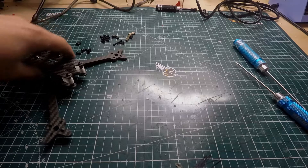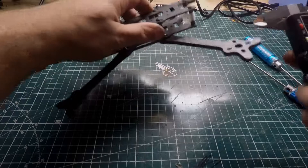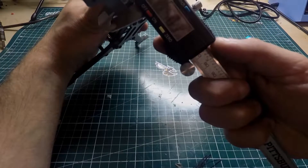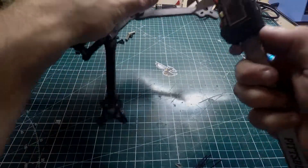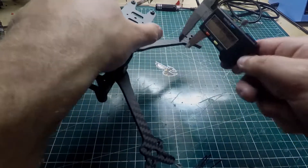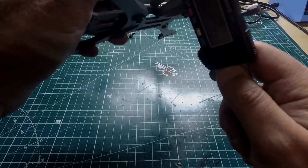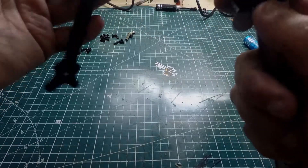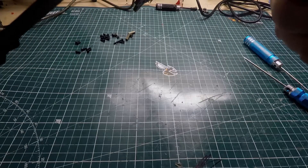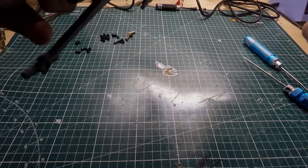I got my handy dandy calipers here. Had some technical difficulties with the caliper but I got it recalibrated. The arms are 5mm thick — that's pretty good — and they are about 9mm wide. The top plate is going to be 2mm, the bottom plate is 2mm as well. And that cross section — if I can get a reading on it — it looks like about 1mm to 1.5mm thick. Actually no, I think that's 2mm too — yeah that's 2mm for the support bracket there.